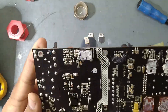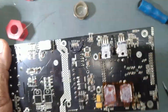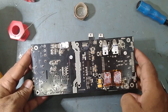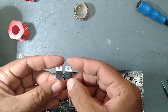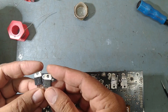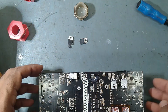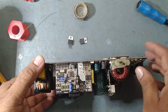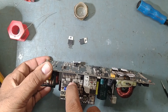We have cleaned this area very nicely. When the MOSFET is damaged, these two MOSFETs — this is the driver MOSFET, N-channel, number 2060C — when this MOSFET is damaged badly, it means the driver IC is also gone. Here is the driver IC: IRS 21678.